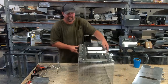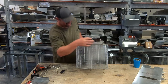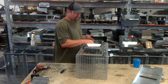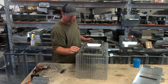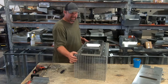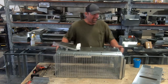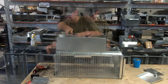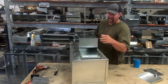Back here, adjusting the latch in and out — there's a carriage bolt right here. You loosen that carriage bolt up if the door is going down on its own. It got banged up in shipping, which happens once in a while, and the thing won't latch at all. Typically there's something back here on this wedge that got thrown around, or it's catching and binding. If that happens, get on the website, get my number, give me a call and we'll walk you through it.